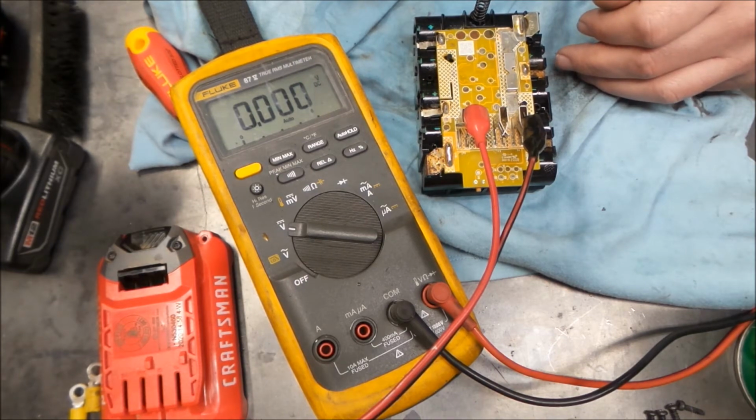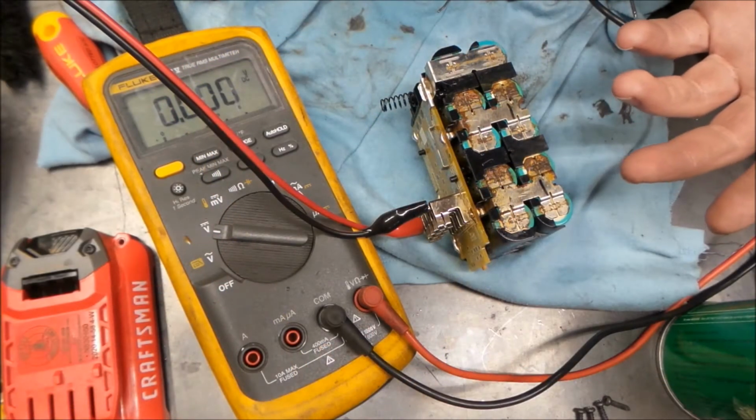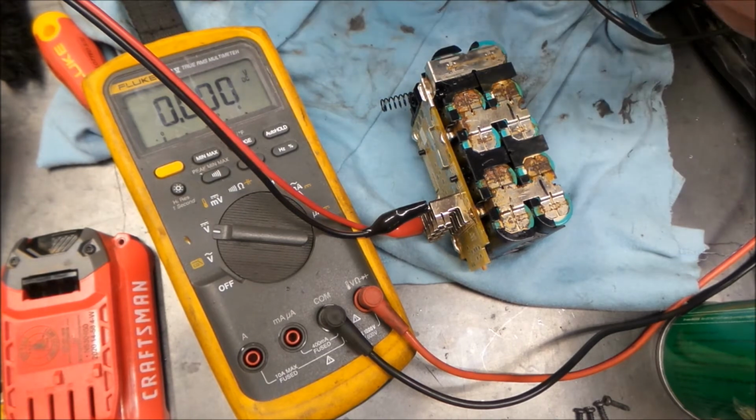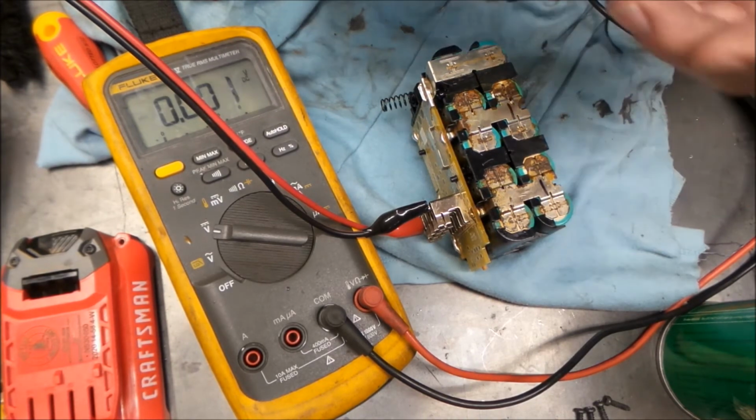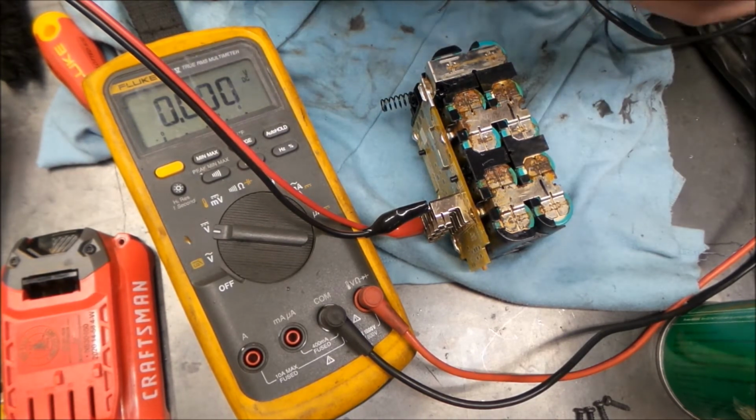And we'll be back. So we're progressing along here. Nothing seems to be getting hot. We're just going up in tiny voltage increments. The battery's still taking a 1/2 amp. I had it disconnected for probably about 5 minutes, and it really didn't lose any voltage. I got it up to about 15 volts, and I left it sit there for 4 or 5 minutes or so, and it stayed relatively within 15 volts.